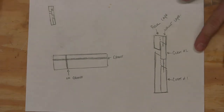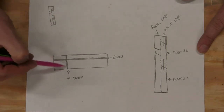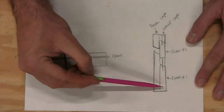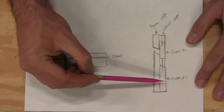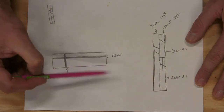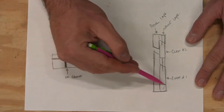It's going to be one foot by three feet, roughly, with a single groove for the pegs, and a strip of walnut running vertically through the top layer for visual interest. I knew I wanted it to sit flat on the wall, but I also didn't want to have any fasteners showing on its face. So I had this idea of having French cleats make up the entire back layer of the holder. I'm also going to reinforce the cleats with trim screws because I have a six-year-old who would more than likely pull it off the wall on a daily basis if I don't.